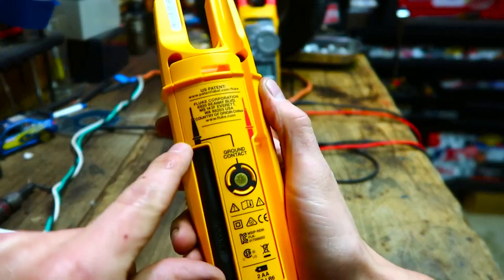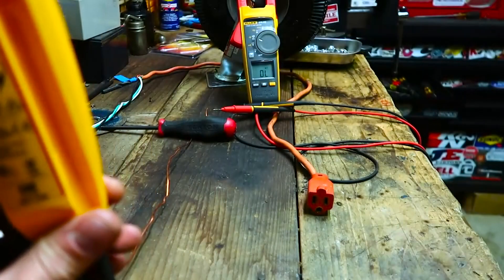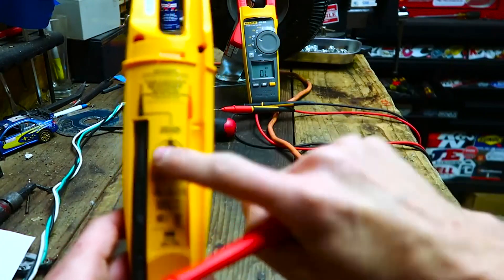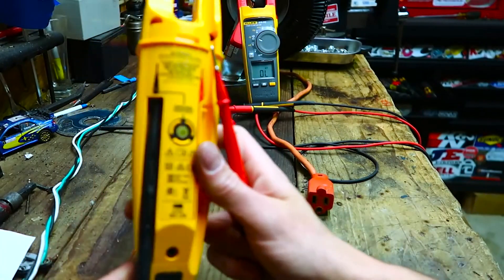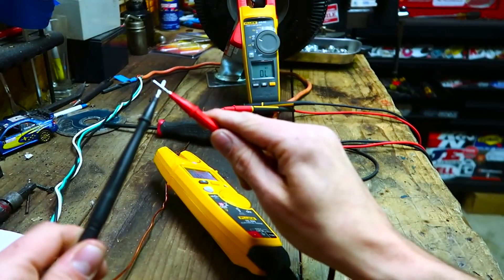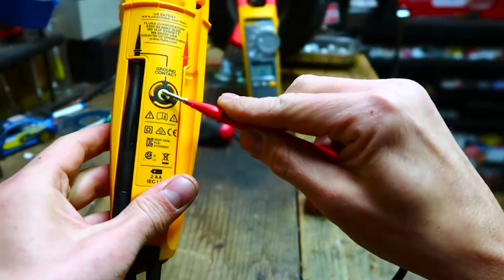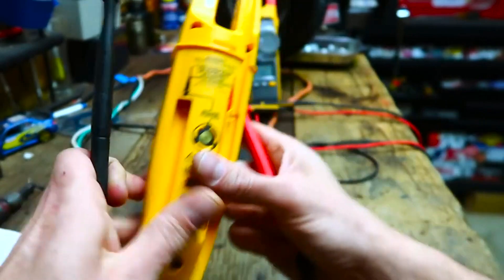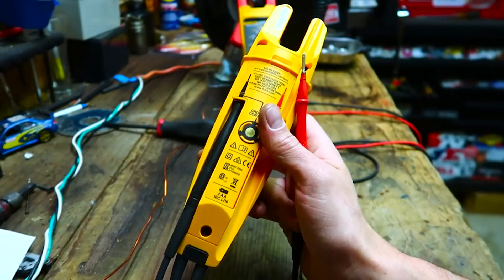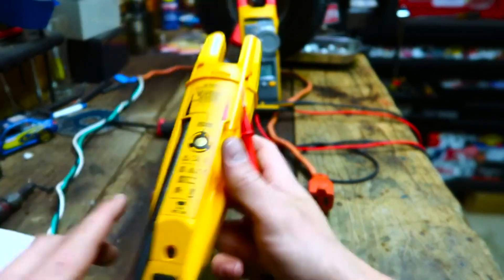The first thing I thought of: I wonder if there's actual electrical continuity between these, because if so, that's not good. That means if you have your red probe in an outlet, it's going to be looking for a source to ground through the black probe — so if you're grounded and touch that, you're going to get it. So the first thing I did with this was put it on continuity. I pushed the probe up in there, that little tip touches a spring-loaded contact, and nothing. There's no continuity. I don't know why there isn't continuity, but I know there's no electrical continuity there.